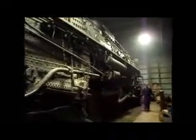Basically, what it is, you open up a valve from the tender, and here's a hose, just like the one on the other side, coming from the tender. And it runs into the injector. Steam comes directly from the boiler and mixes directly with the water, so you don't need to heat it through a feed water heater here. It just goes directly up the pipe and is forced into the boiler like you saw up top there.